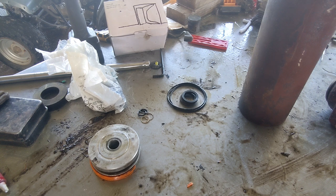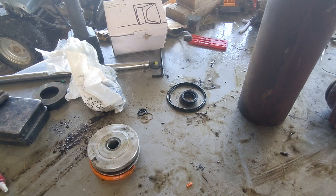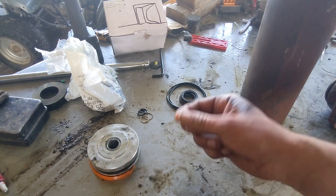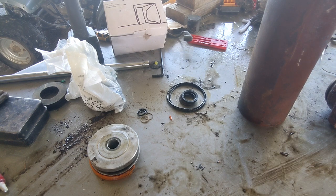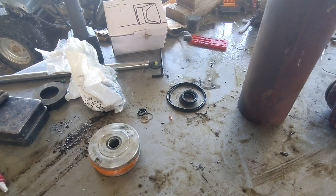The good news on my tractor and my neighbor's tractor, the one that was actually pulling this plow, is that the filter is on the suction side of the pump. So at least it can't get in the pump because it'll catch it in that 5-micron filter for sure. But yeah, I'll probably just go ahead and buy her a hydraulic filter. We can change that filter, and then I want to cut it open and see if we find a bunch of orange stuff in there, because my suspicion is that we would. So yeah, okay. Anyway, there it is.